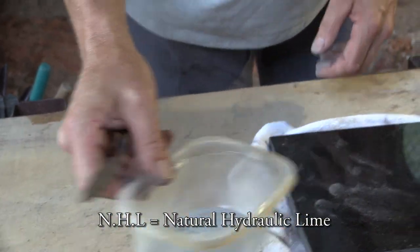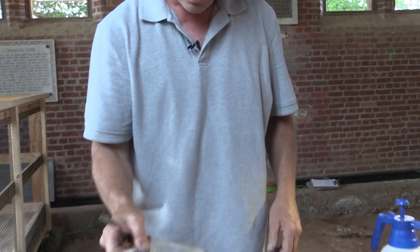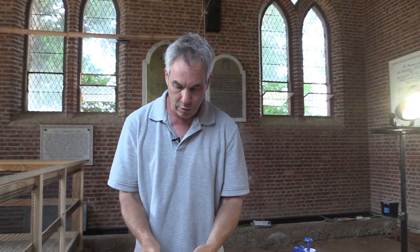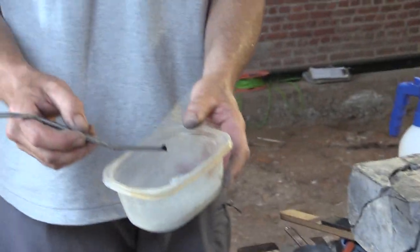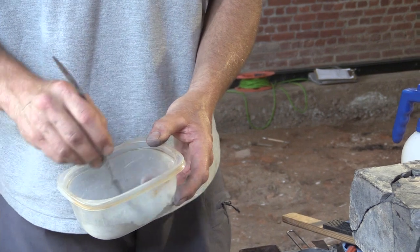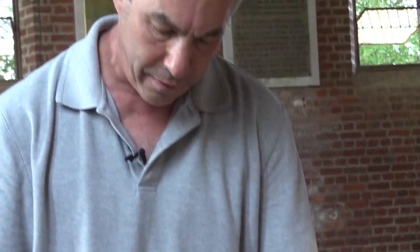The NHL is going to lighten it up a bit. You can take some of the original stone color and match it — it's actually a pretty good match. There is a big variation in the color of the stone itself, which is typical in a dark stone. Now we're going to add a very small amount of dark black iron oxide based pigment to enhance the color. Without a very sensitive scale, we'll do this by eye.